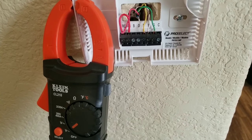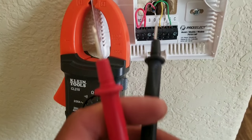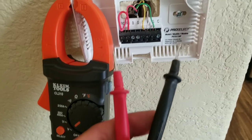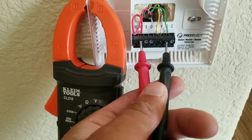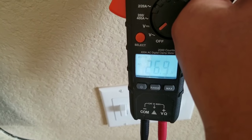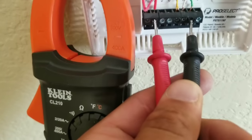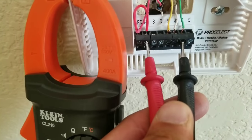Here we just want to check the voltage going to each terminal. As you can see in my wiring video on my channel, this red wire is our 24 volts coming down to the thermostat. We can easily check this by going from our red to our green. Our green is the blower motor — you can see here I have 26.9 volts. The voltage can read anywhere from 24 to 28 volts, so this thermostat is sending power for the blower motor to turn on.